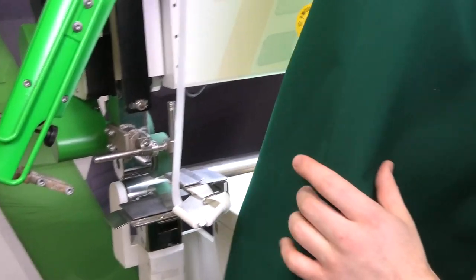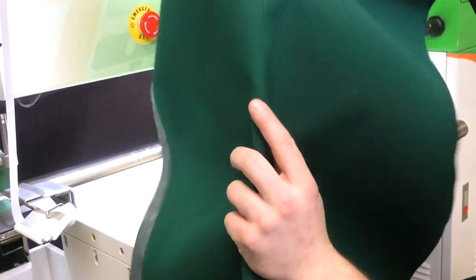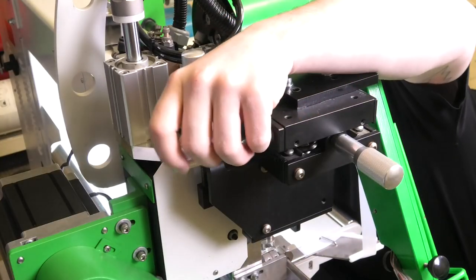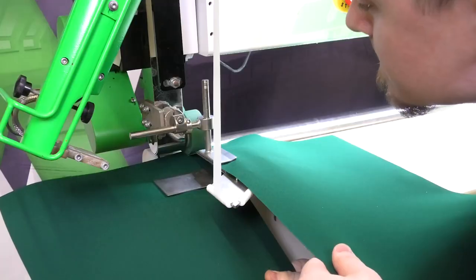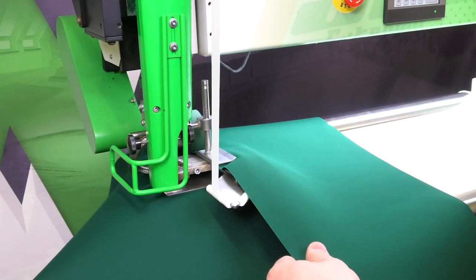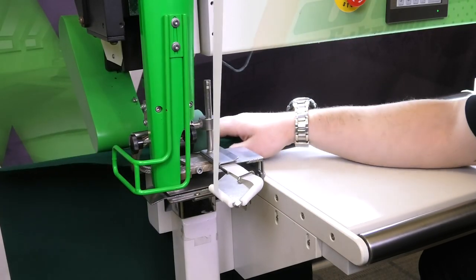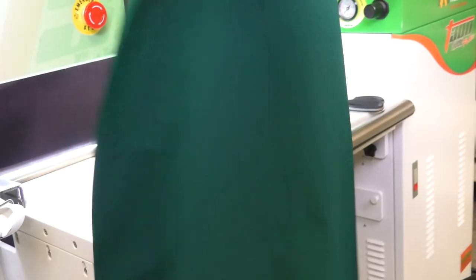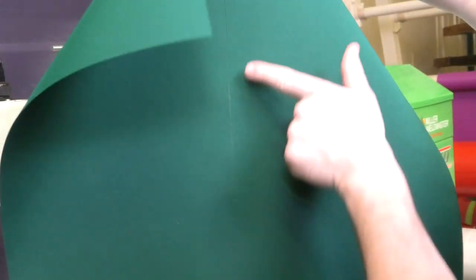If you adjust it too deep in, you're going to start seeing a whole bunch of ripples on the seam itself. I can do a quick sample of that — I'm just going to crank this in. It can also look like this if we're just too hot, really just cooking the material. It's also going to make it harder for your operator to control the material. You can see that turned out pretty well, but you can kind of see where it's starting to warp here and there — though that's very faint.